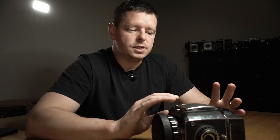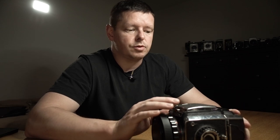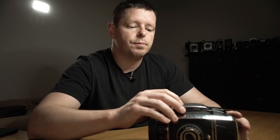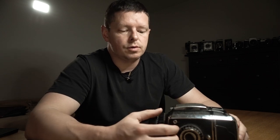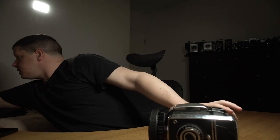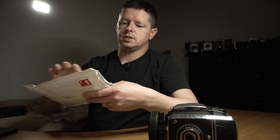The process: I'm going to need to remove all the leatherette and get this down to just bare metal, removing all remnants of the old glue before I try and put on a new cover, a new skin. I have a new skin - I bought it from a company called Millie's Cameras. They are also, incidentally, the same place that I get all my light seal foam from. They're really useful - there are some really useful bits on there. I'll put a link in the description.